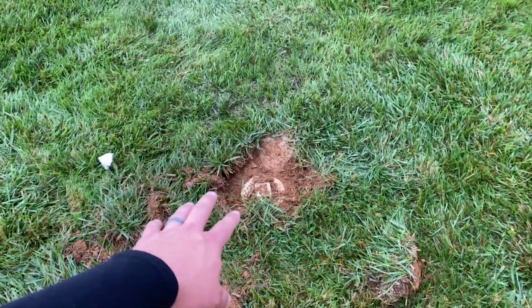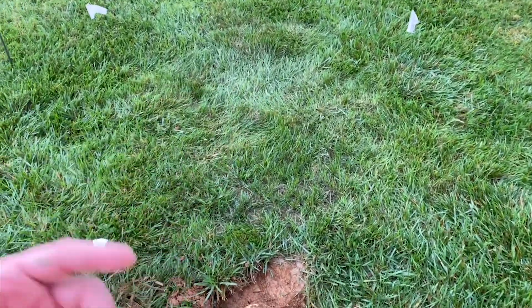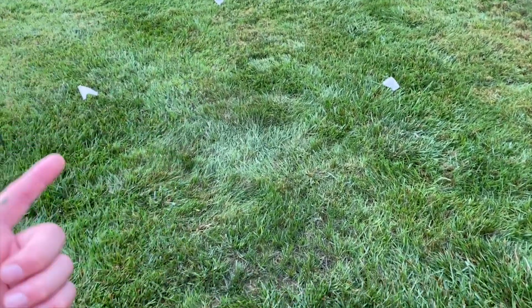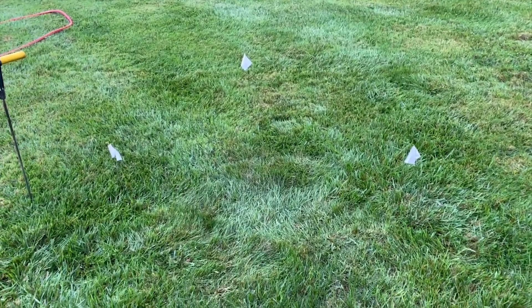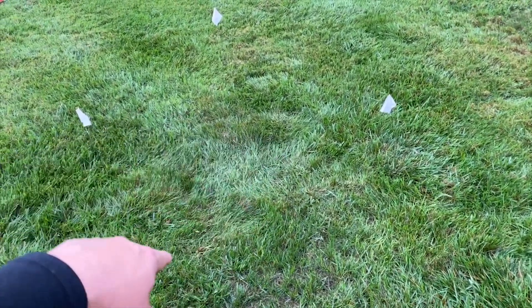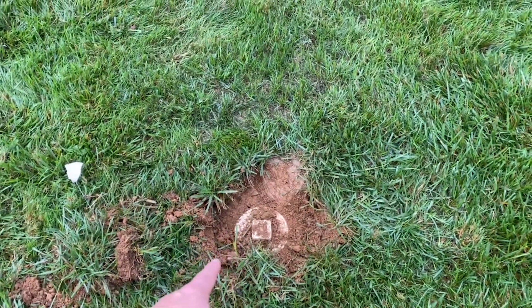This lid is going to be on the front of the tank. We usually recommend that people consider putting a riser in the middle, and the reason why is from here to there is going to be roughly about eight feet. The problem is when you pump the tank from this end you're going to have a really hard time getting all the debris from the other end. So the manhole riser would go in the middle, and we recommend this for every single tank. I'll get into that in a few minutes once we take a look inside the system.